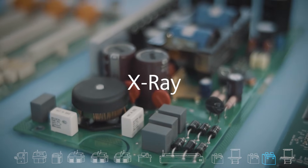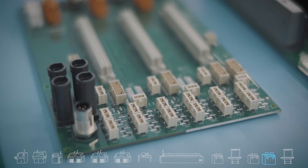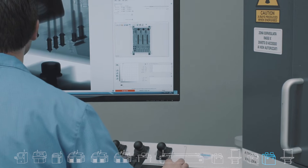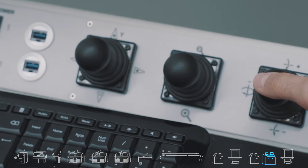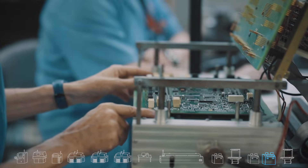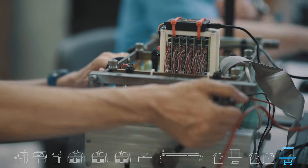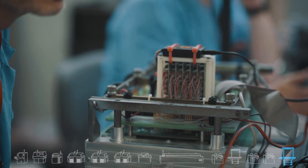For large BGA components we need to check that the pins reach the right layer. These pins are usually behind the component and therefore cannot be tested with AOI machines. In this case we use an X-ray to take an image of the PCB and make sure that the connectivity and the soldering is adequate. Now we can actually test the functionality of the completed product. The preference is always to find issues through the different processes and avoid finding defects at the last stage of the functional test.